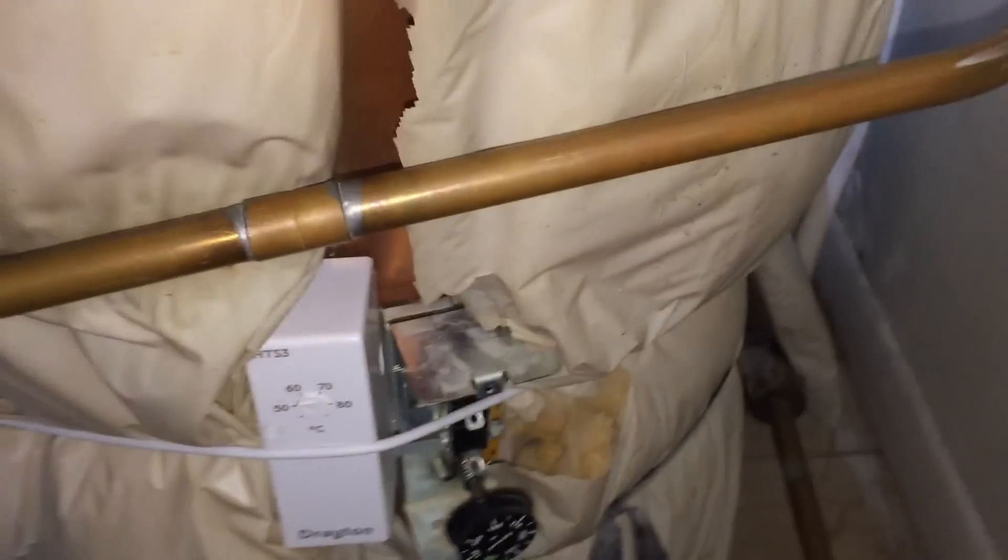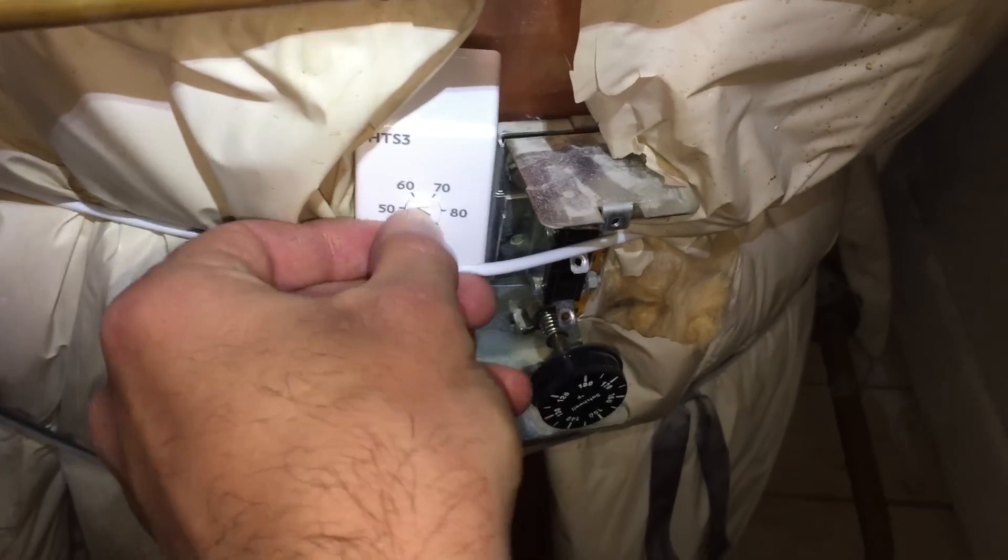75 volts — that's the sort of back-feed you get from three-port valves, so that's fine. Let's turn the cylinder stat down — the grey should then get 240V and we should lose the 240V on the orange. So that pipe goes in there, into there. Let's feel this — quite warm. Let's feel it here — very hot indeed.